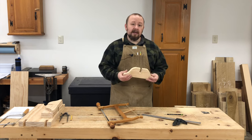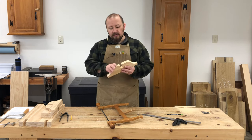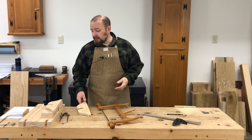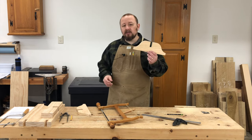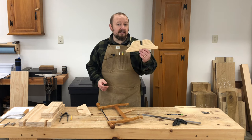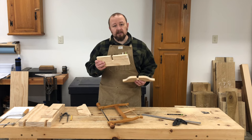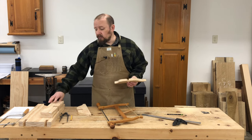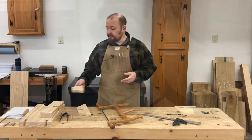I'm going to go ahead and do so with my stretchers, not just for that tactile experience, but because once it is smoothed out, I can then use that first one as a template and just trace the pattern onto my other stretchers and not have to repeat the compass layout on every single one.